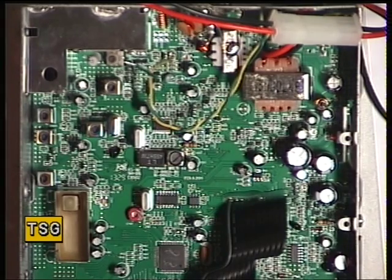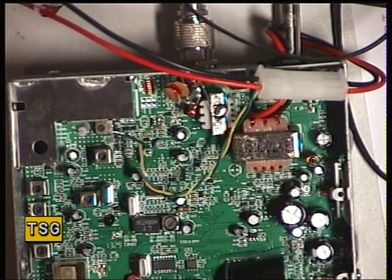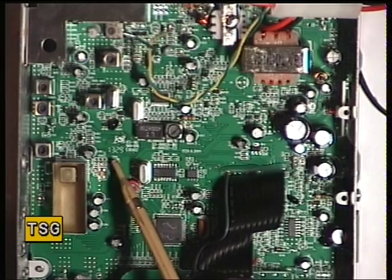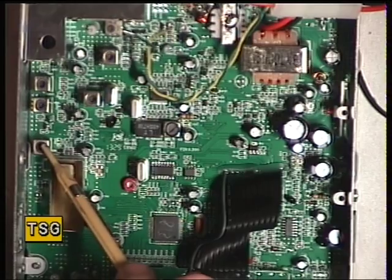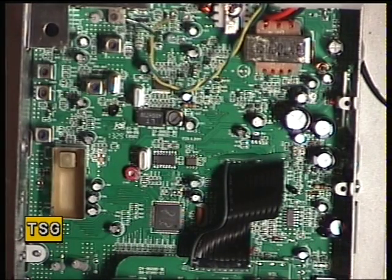I've worked out from this that we're looking at the first coil for optimization for transmit. The VCO is going to be set — it's a new radio — and the VCO is clearly that coil there, and there is a VCO test point. I would need the proper service manual to do that. L302 appears to be the first one for transmit. Going into transmit, it's currently doing exactly three watts, but it's not on channel 20 — it's an up/down mic so I'll just whip up the channels to channel 20.